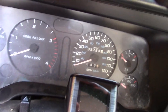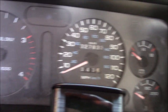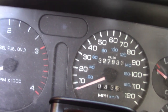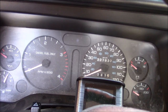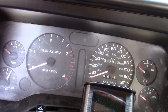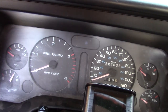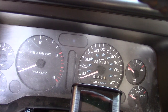The ECM does control the alternator, the speedometer, and the tachometer, and there are ways to bypass most of that, but I kind of want to have that odometer working just to keep racking up miles. This thing didn't completely fail immediately — over time the speedometer intermittently started having issues, reading lower than it should. I thought it was the speed sensor on the transmission, but after a couple of months everything just gave out.